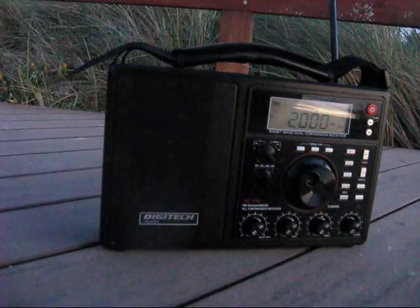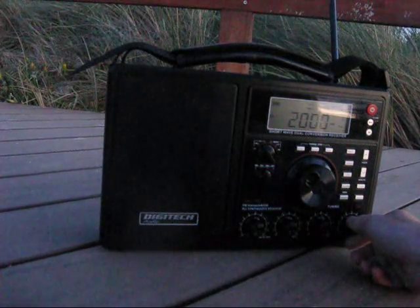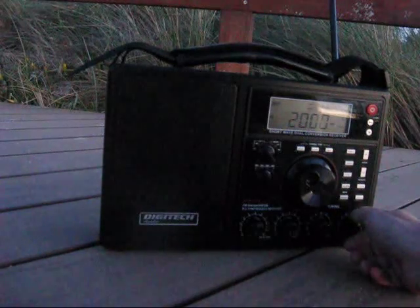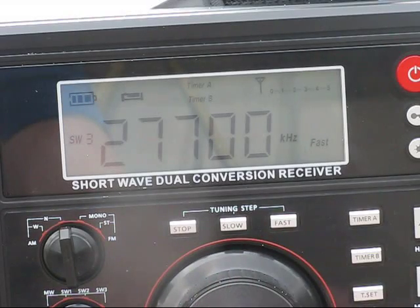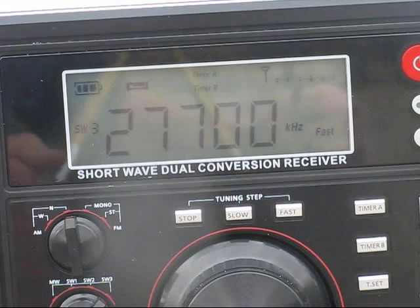The radio's front end is not ideal. Here at 2 MHz you can hear signals that are obviously out of place from the AM broadcast band. The front end of a broadband receiver like this obviously involves some compromises and isn't as sharp as we would like.